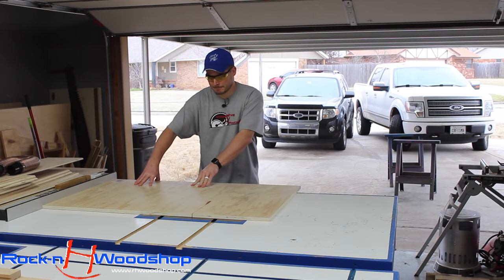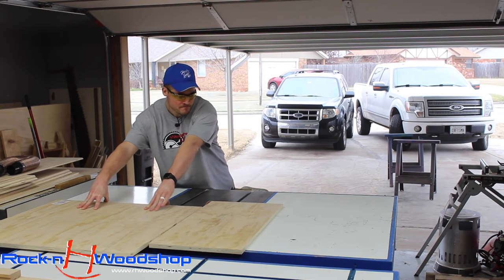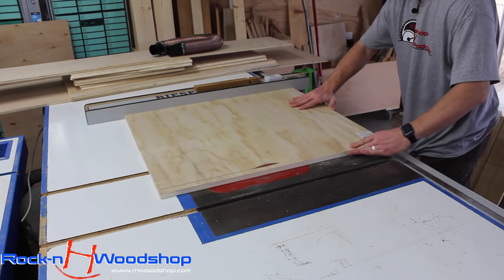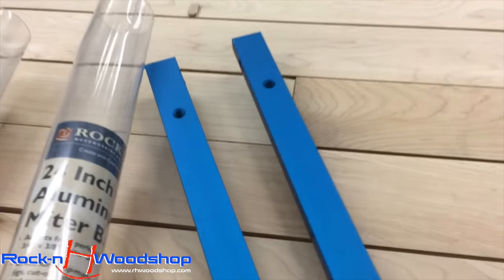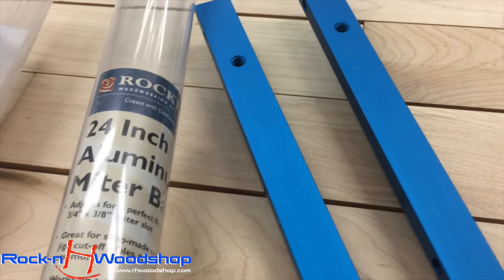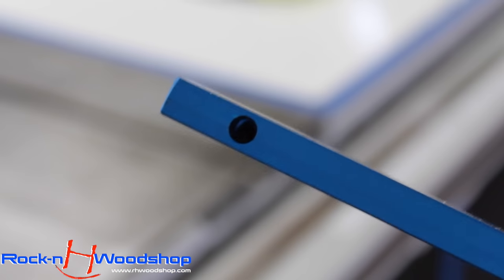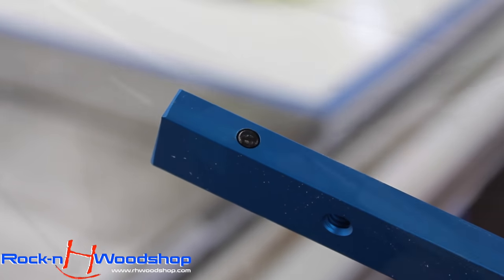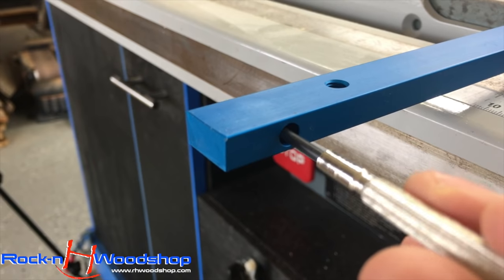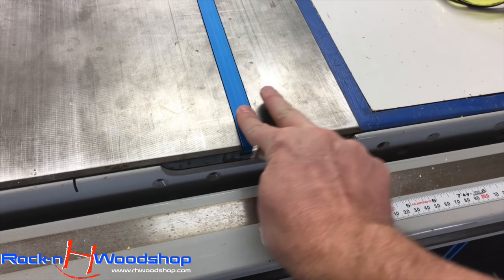Once I'm done, I put up that sheet and cut it down to size on my table saw. I plan on using solid aluminum 24-inch miter bars. The reason for that is because I've made wood runners in the past, and due to expansion and contraction, even though I made them with quarter-sawn oak, they still sometimes drag. These aluminum bars will eliminate that inconsistency. Plus, they have adjustment screws made from nylon that you can adjust over the course of time if your sled gets a little sloppy.